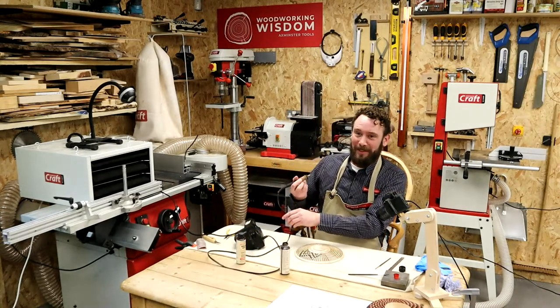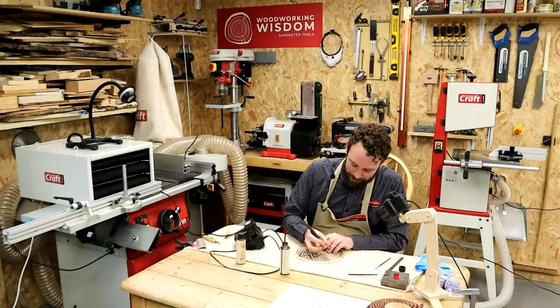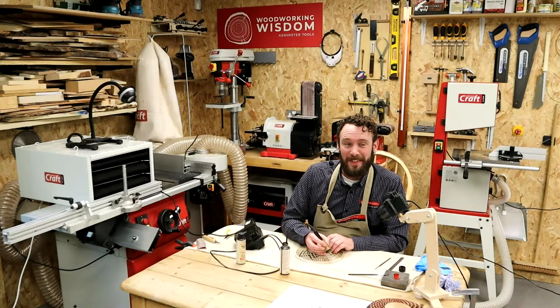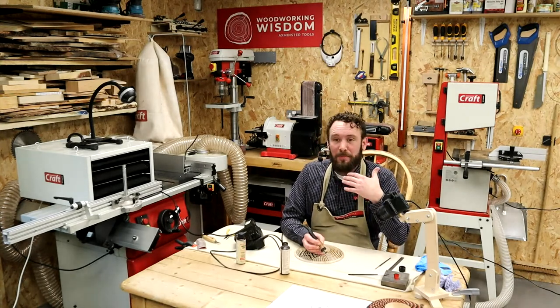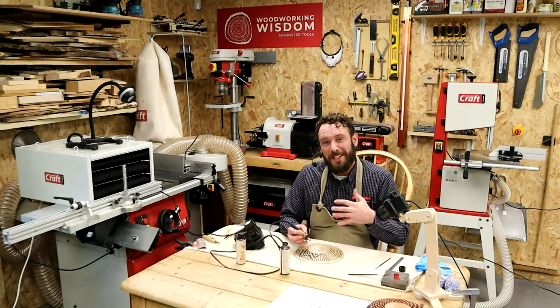I'll look into that. And Frederick said, a good tip potentially is to divide a segment into three on a 24 dividing head and you'll get 72. Great. Yeah, so you can break it down lots of different ways. You can divide it by three. And you might want to use a little bit of math.